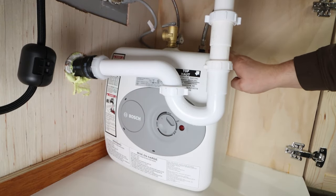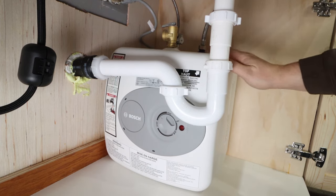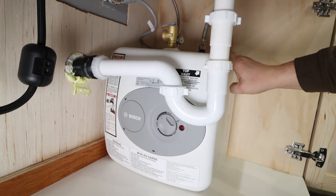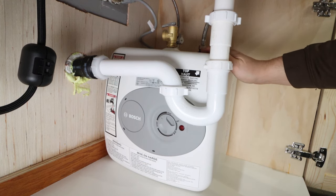Now we just need to wait for this to heat up. This wraps up the Bosch four-gallon hot water heater install. We tied into the main water line, plumbed it up to the sink, and got it plugged into the wall. We made sure all the plumbing and everything else is going to be nice and out of the way. We were able to save a lot of space because of the unit size — roughly 13 and a quarter by 13 and a half by 13 and a half. Nice and small, compact, and out of the way. Very pleased with it so far. The price was right on Amazon — there'll be a link in the description. Overall, I really hope you guys enjoyed and got a lot out of this one. Until next time, thanks for watching.